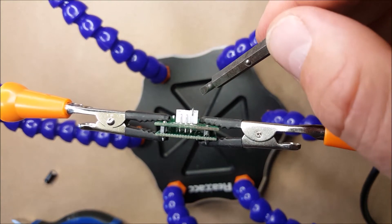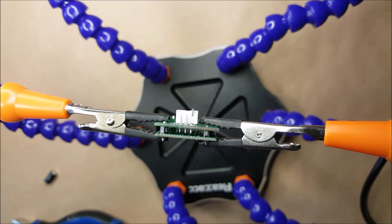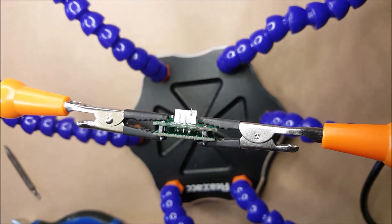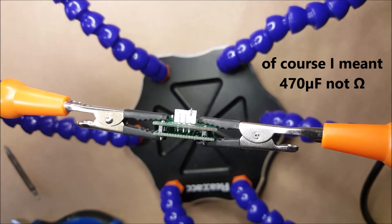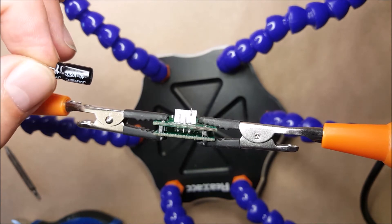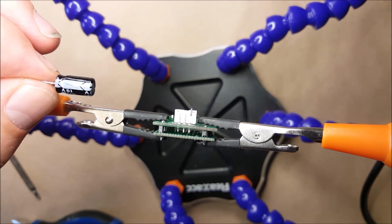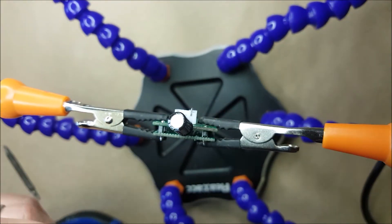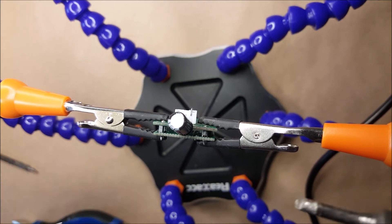That basically means that when I plug something into this plug the power is currently not connected. The first thing I'm going to solder in is this resistor. I didn't have the 330 ohm value that I saw other people using on the internet, but I've got a 470 and that'll do the filtering — it's a little bit larger than I'd perhaps have liked, but that's what I'm going to solder in. Just being careful about the polarity — this one's marked with a nice minus down one side — I'm just going to pop the capacitor into place.